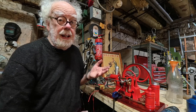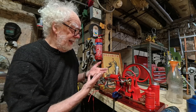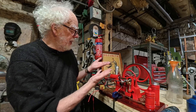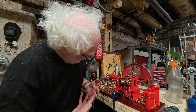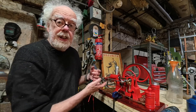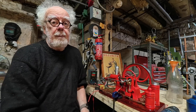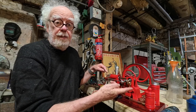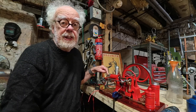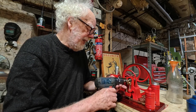You know why it stops? It stops because the carburetor isn't good enough — it needs more air and a dialled-in mixture. The poor thing is struggling because it's running so rich, kicking out smoke and oil because it's desperately trying to breathe. The fuel is still up in the carburetor which is great, but it ran super rich, then super slow, then quit. Keep fiddling with it and you'll get it running nicely, but with unpressurized fuel and such a simple carburettor you will be running it super rich.